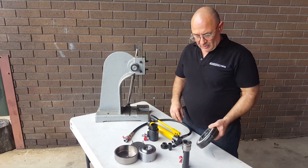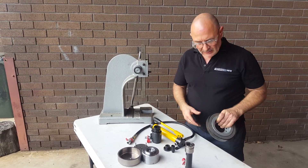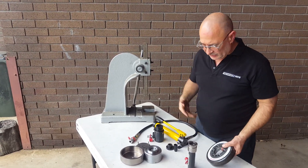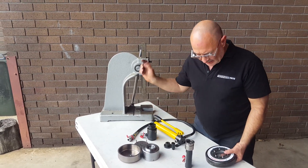With the balancer, the easy part is to take out the inner ring. The intermediate ring in here is the hardest part. So what we'll do is show you how you would do this with the 10-tonne cylinder without an arbor press.